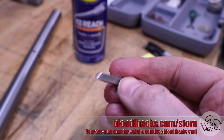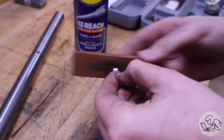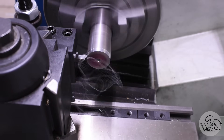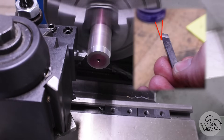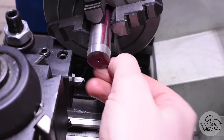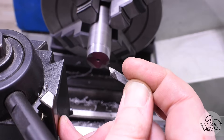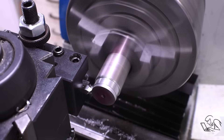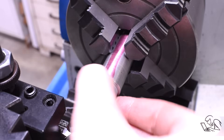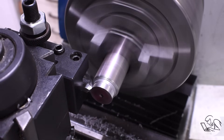This piece of high-speed steel is from a scrap bin of HSS chunks I got from a viewer. It had a cutting edge ground on it from a previous machinist, so I honed that up and did a test cut on some steel. It cuts fine and the surface finish is solid, but it had more lead angle than I'd like and I could feel the tool pressure was a little high. Because I'm going to be battling low rigidity with this boring bar due to its length, I reground that tool with zero lead angle and evened out the top rake — cutting extremely well, breaking nice chips, and tool pressure is low. However the surface finish was poor, so I took a stone and put a little nose radius on it, and the difference was night and day. A little bit of nose radius makes all the difference.